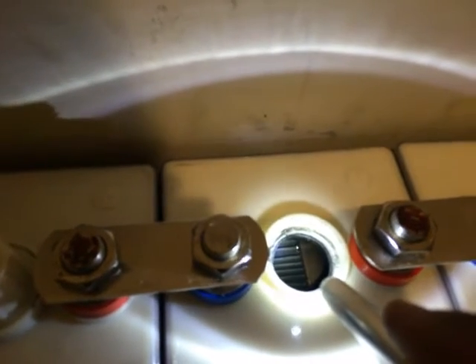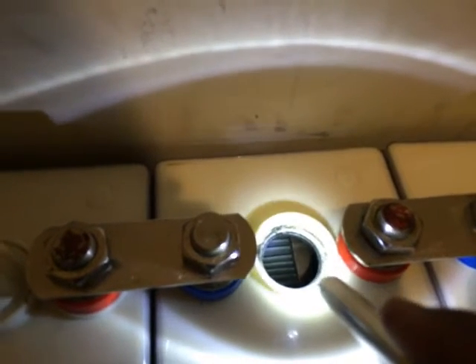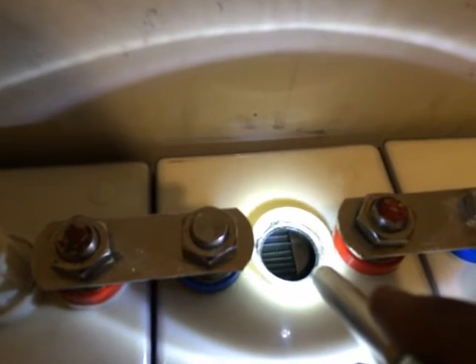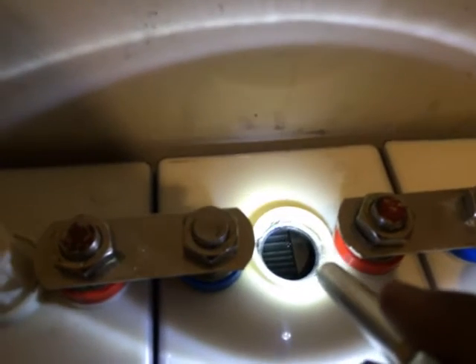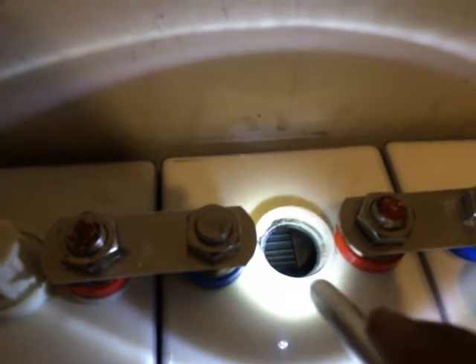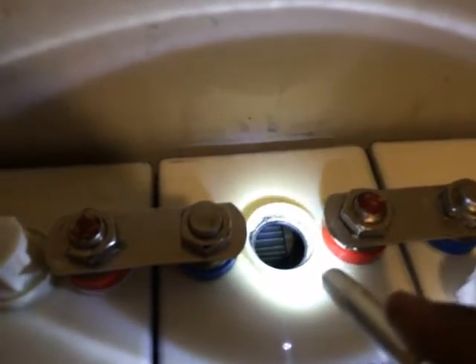Also, to get a good idea — if you look closely you'll see bubbles forming. Batteries have to be watered after they are fully charged, so you'll see bubbles forming, and by looking at the bubbles you can gauge how far that water is above those plates. That's how I gauge it, then I'll put some water inside the measuring cup.